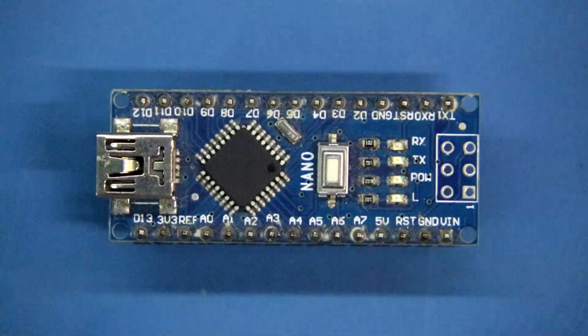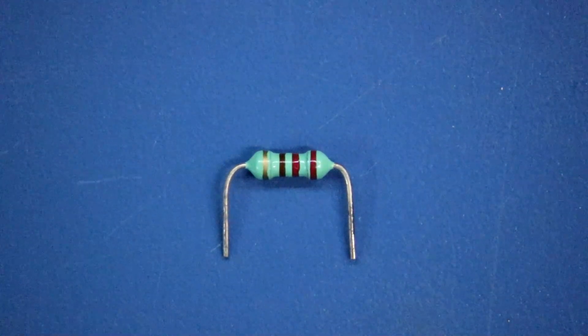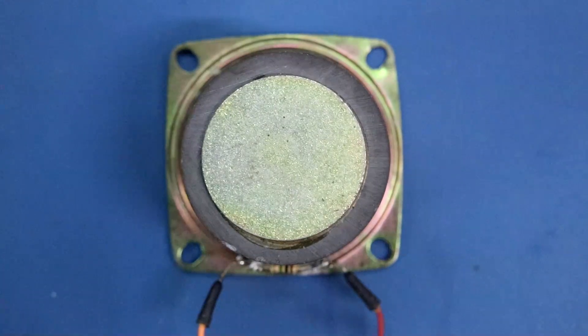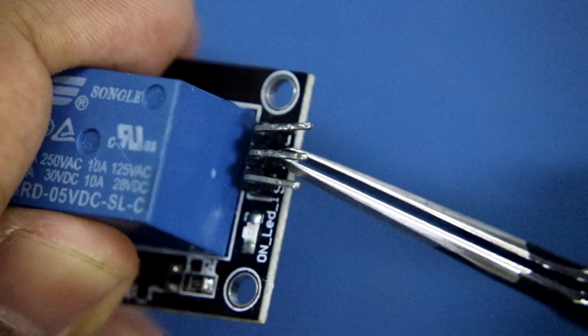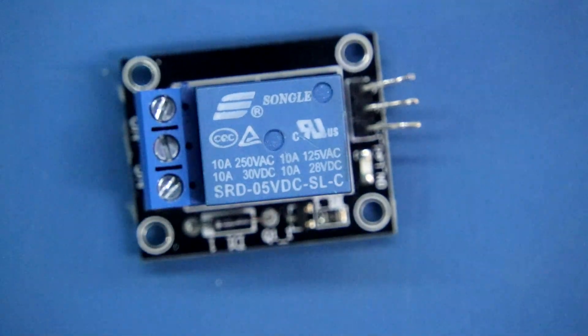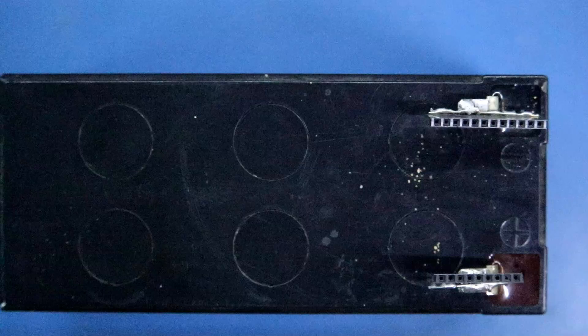Now we will make this circuit on a breadboard. Components needed: Arduino Nano, 10 kilohm potentiometer, push button switch, 10 kilohm resistor, 220 ohm resistor, green and red LEDs, a 12V solenoid lock, a speaker with a 1 megaohm resistor soldered across it, a 16x2 LCD display, and a high-trigger relay module. For the power supply I am using a 12V battery.